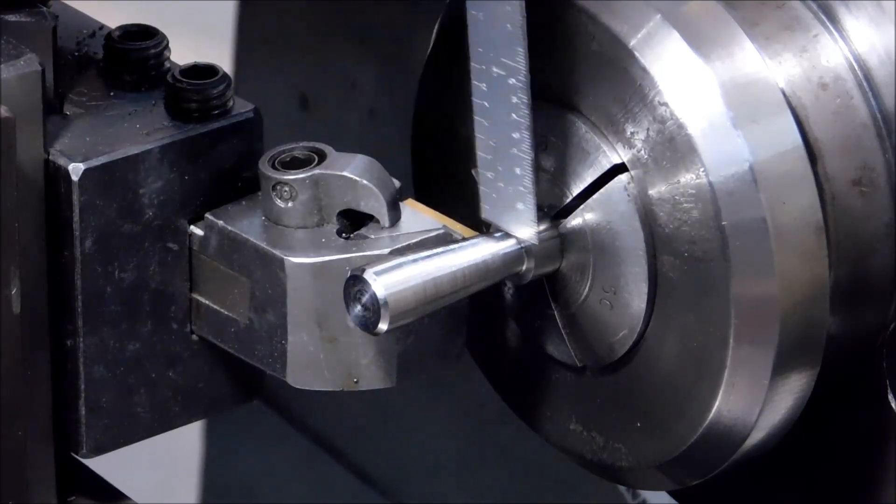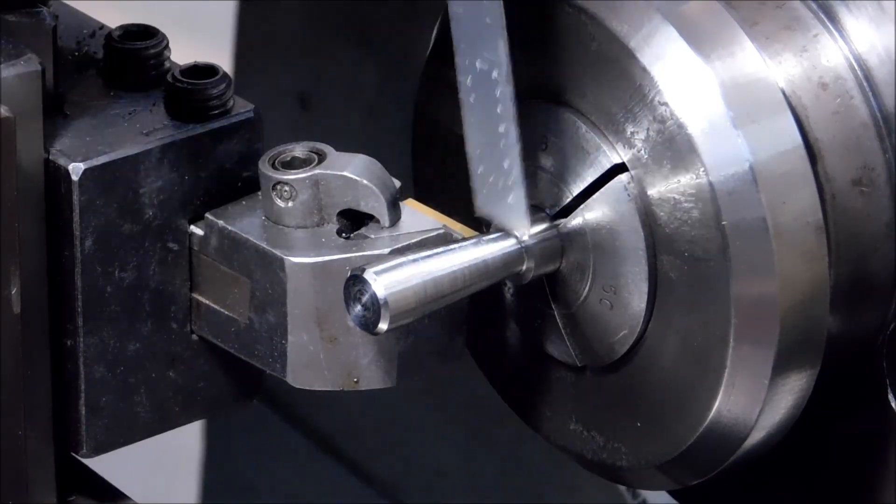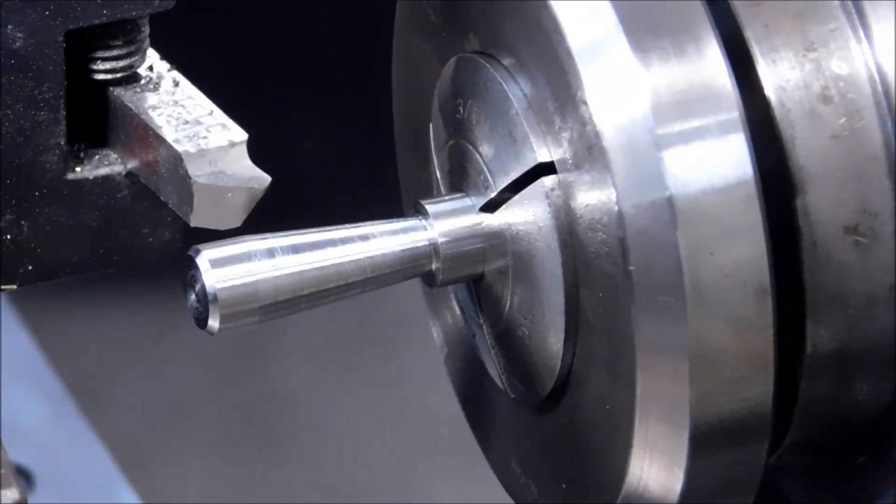We're going to drill it out, and this is going to be very thin if you go too deep. I'm using a number 10 screw — this should be about 240. Let's put a small chamfer on that section that's closest to the collet. Flip this piece around and do exactly the same thing to the other side.